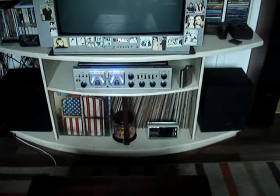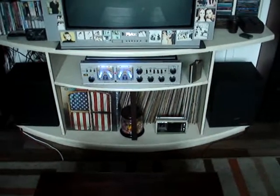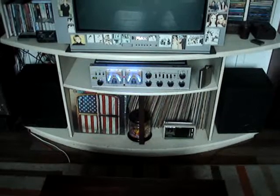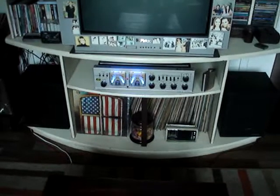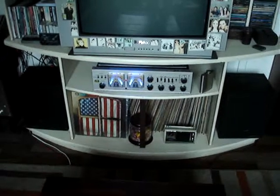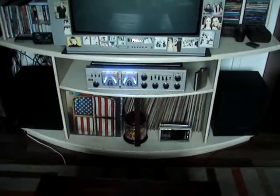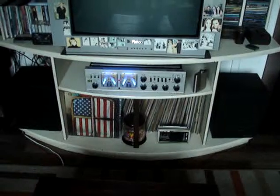I am Regis Davi, from Etsy Retros, Curitiba, Paraná, Brazil. I demonstrated a pair of Sharp brand speaker cabinets, from which I removed the original drivers and installed 200 watt RMS woofers in each one. I also removed the original tweeters and replaced them with tweeters with stronger magnets, approximately 75 watts RMS. The Bass Reflex port I extended to the bottom of the cabinet, producing greater bass response.